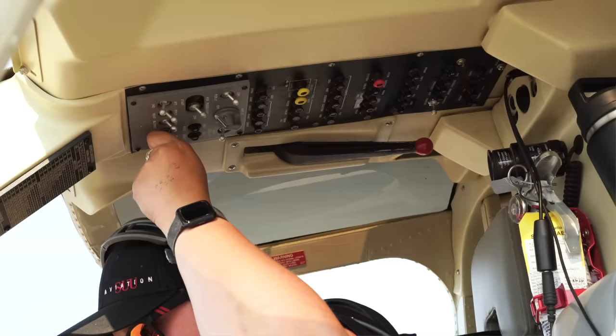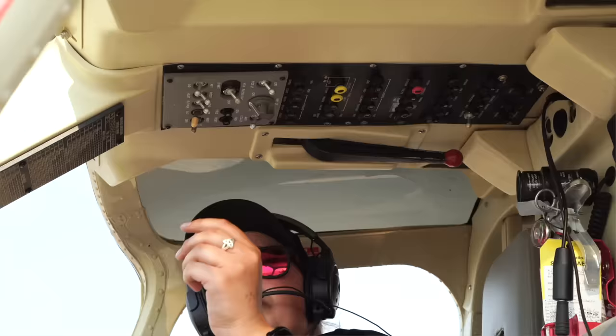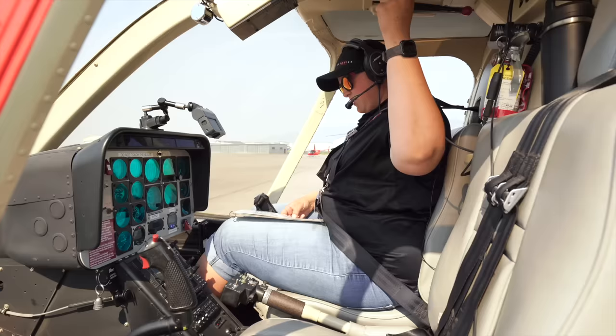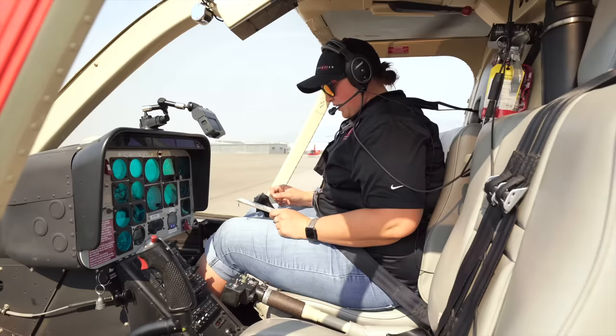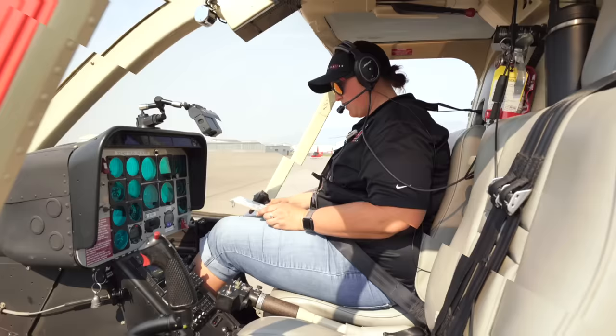Now we're going to do TOT2 stabilize for two minutes — kind of a two-minute cool down. Battery switch off and on, watching for a decrease and an increase. Left boost pump out. Engine anti-icing is off. Directional gyro, attitude indicator, turn indicator off. ELT check for inadvertent transmissions — good there. Then radio nav turn off.